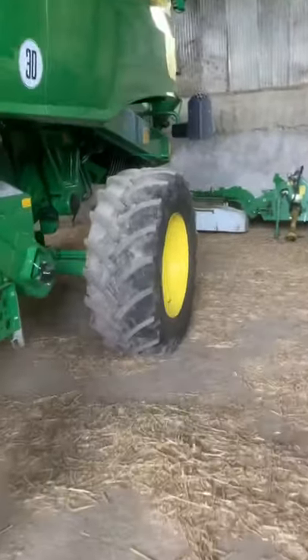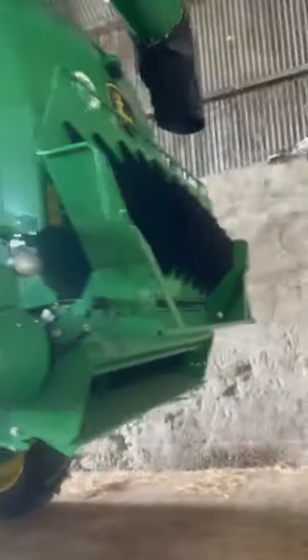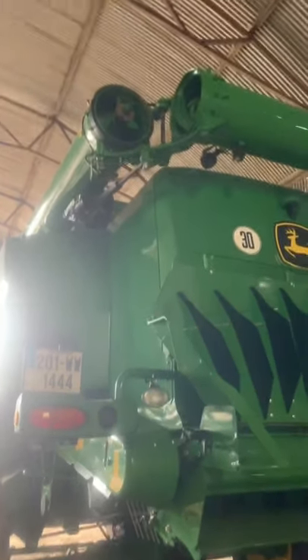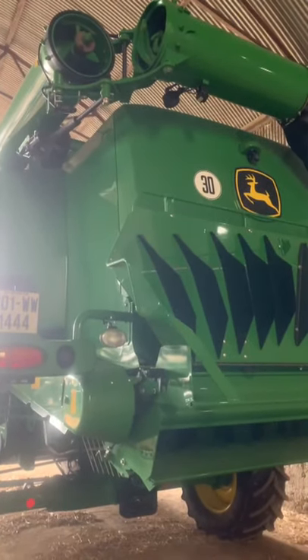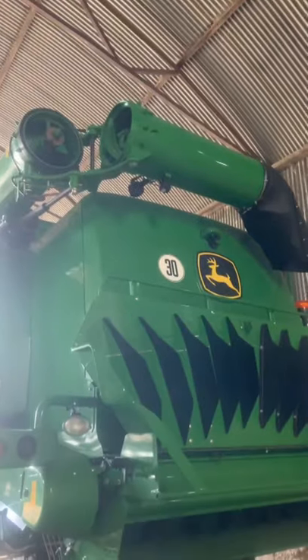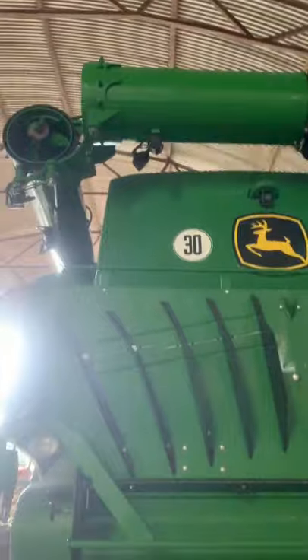She's fitted with the bigger wheels at the back and we have chaff spreaders and a chopper box. I also opted for the folding chute because for output and efficiency we like to unload on the go. With the old combine we either had to drive on the straw or only take half the width of the header, so we put the longer chute on this one so it's pushed out past the straw and there wouldn't be any trampling.